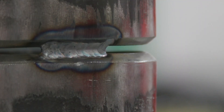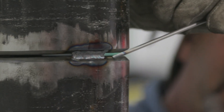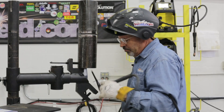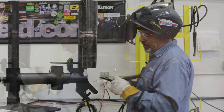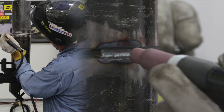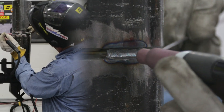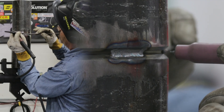2G. I had two tacks in here about an inch long. I'm gonna start on this one back here. A couple of different methods for horizontal that I like to use that are comfortable for me. I like to rest the heel of my hand on the pipe down here, and I hold the stinger like a pencil, so I can get going and do whatever manipulation I need to do with the tungsten.